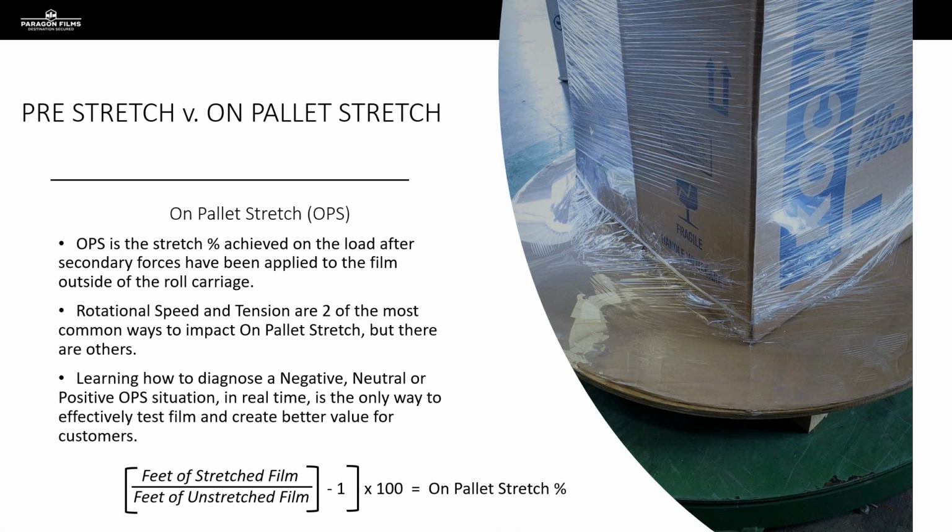And it's important to know because we need to know pre-stretch before we even start diagnosing on-pallet stretch, because the relationship between those two is probably the most important point that I use when I'm in the field doing film audits. Knowing where I stand with pre-stretch and what I'm achieving on-pallet stretch in real time while I'm standing there with the customer are the best two data points I have to know how much yield I'm getting out of the film, how well I'm optimizing the film, and what is the real potential for showing that customer a cost savings because I'm offering them better performance.